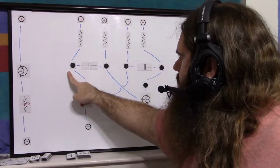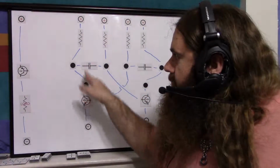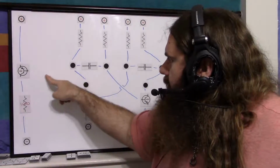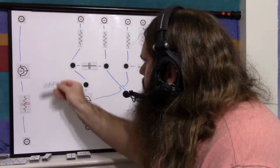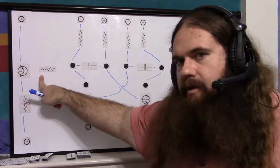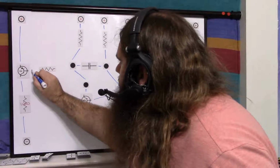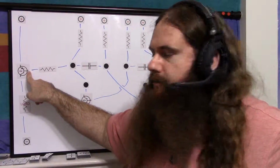through the emitter to base, through a junction, collector to emitter, and negative, which means we have no explicit resistance through that particular path. So when this transistor is on, this transistor will be on as well, because we'll have low here connected through low here, which will turn on the base. That's how this works, and high there. So we do need a resistor, and we'll put a resistor here. And this works well because we can have a different voltage drop for the emitter to base, which is just the turn-on current, it's a necessary evil, and then a separate resistor, it's a separate voltage drop across the actual load. So we connect it like this. So when this transistor is on, we get 0 through there, which means we're going to get 0 through here, roughly.